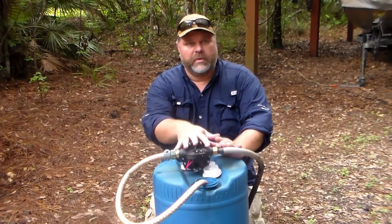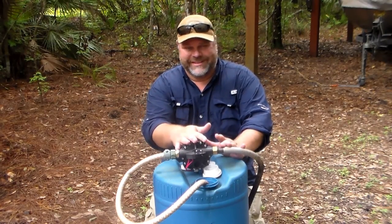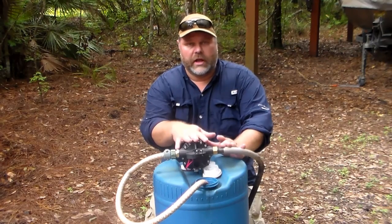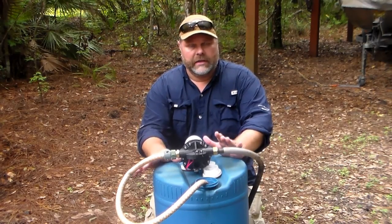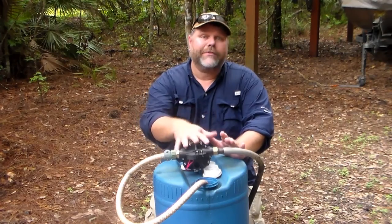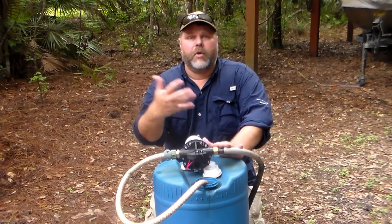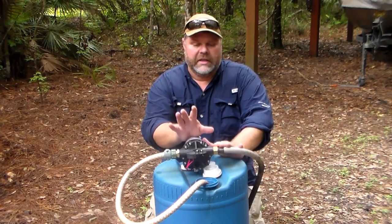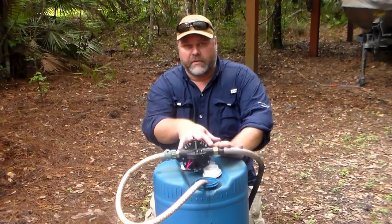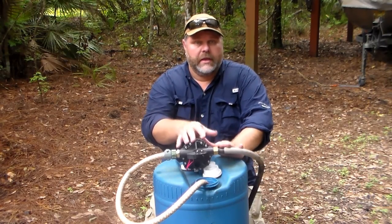In closing, guys — little 12-volt on-demand pump. I was wrong earlier: it's a 5-gallon-per-minute, 45-PSI cutoff, 60-PSI max pressure pump. You can get these online; there'll be an article to follow the video with links where you can get these and the 15-gallon drum. Handy, easy way to store water and put water back in your house. We've got more videos coming up showing this system used for things that aren't necessarily emergency-related but are fun and handy. We also have a power system video coming up — a set-it-and-forget-it kind of system. Thanks for checking us out; we're gonna head in because the weather's moving in.